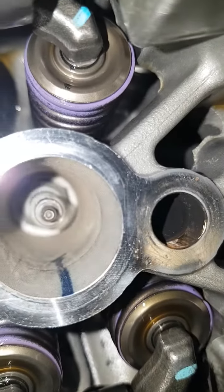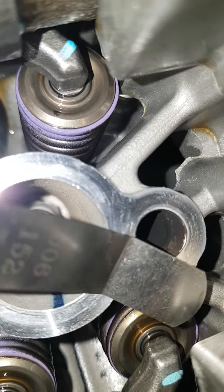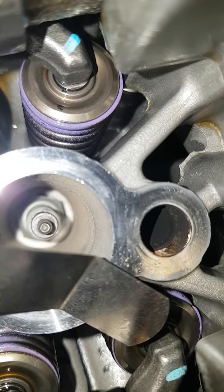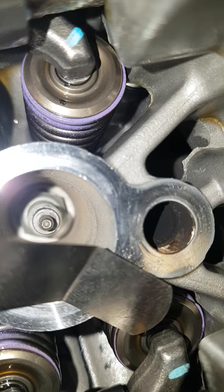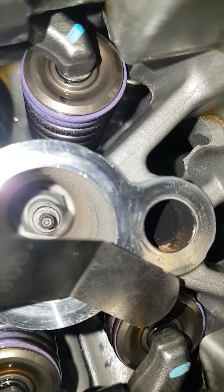You're going to be sticking it in there — I'm not going to try and get that on camera. You just slide it in, and if it slides in too loose then you go up a size and see if the 0.007 will go in, then after that see if the 0.008 will go in. And if you can't get it in, that means you've got to go to a thinner shim.